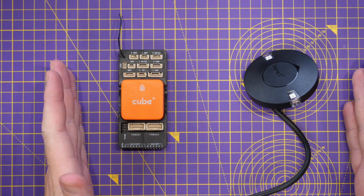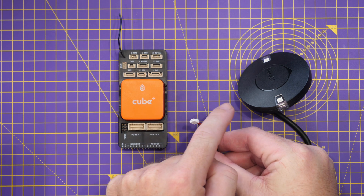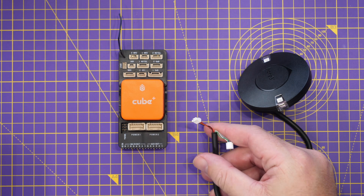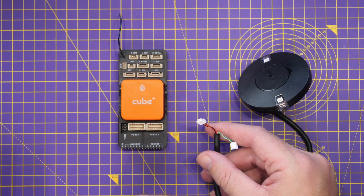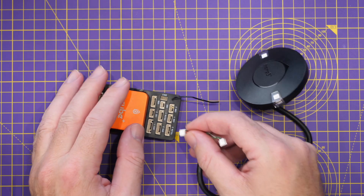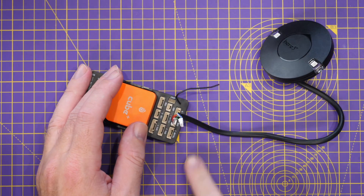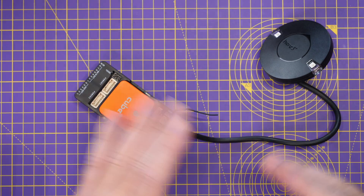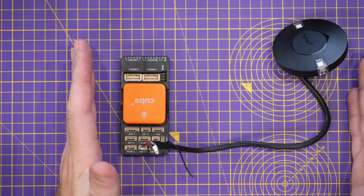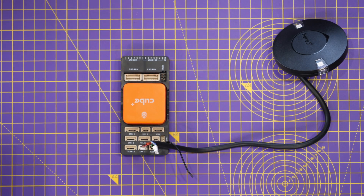So, to walk you through how to set this up — we've got two connections on here. At the moment, the one with the green wires is not used; that's for the future use of the internal Remote ID module discussed earlier. We're going to take the one with the red and orange wires and plug this into CAN port 1. You could do it into CAN port 2 depending on your setup, but for the purpose of this I'll do CAN 1 and show you the setup for that.